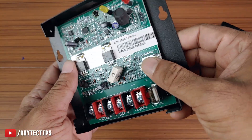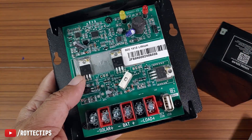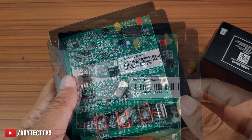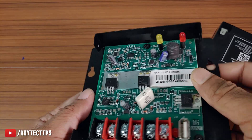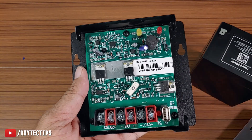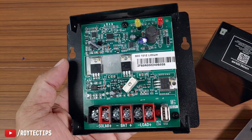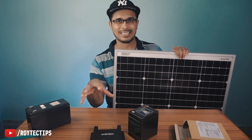If they had included even a little heatsink, I would be a lot happier. I'm not sure how much heat this charge controller will generate, but if it generates a bit more heat that will be really bad for it. If it gets really hot while charging, we may need to add a metal heatsink. So let's cover it back up, take it to the roof, and do some testing to find out how much heat these MOSFETs are generating.